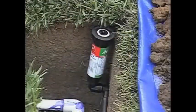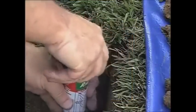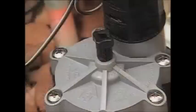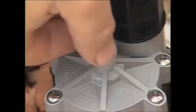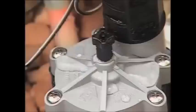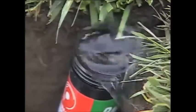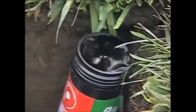After all the pipe has been laid and the sprinklers have been installed, the next step is to flush the system. Take the tops off all the sprinkler heads and turn on the water at the main system control valve. Now use the bleed screw to open the zone control valves one at a time — turn the bleed screw a quarter turn and you'll hear the sound of water rushing as the valve opens. Flush each area until the water runs clear. When you turn it off, turn the bleed screw clockwise and hand tighten only.